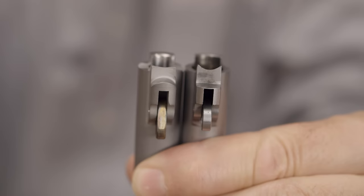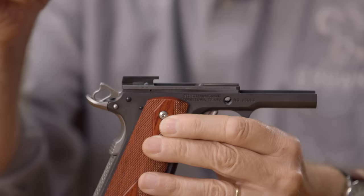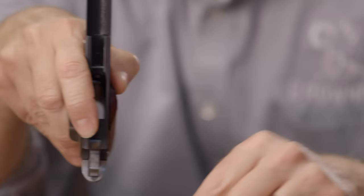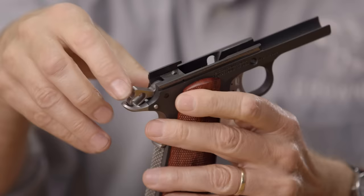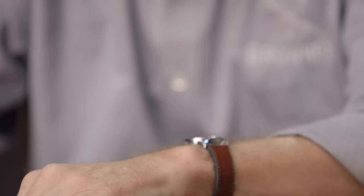These do not interchange, and there's a reason for that. If you're cutting a frame for a Wilson Nowlin ramp, you first cut the groove that accommodates the feed ramp and then the seating portion is cut vertically — you plunge cut it with an end mill and put that flat back there to match the flat on the back of the ramp. With the Clark Para, you mill the whole thing horizontally — you do the groove first, then plunge down a little deeper and put the step in. That leaves a radius to accommodate this and lets it butt up against the frame properly.